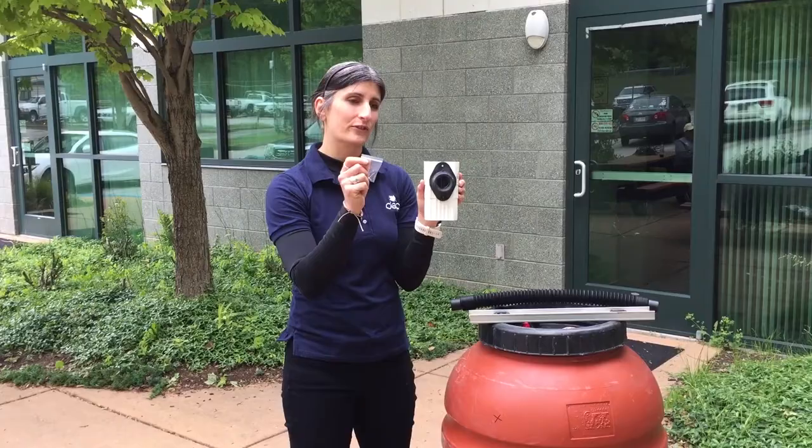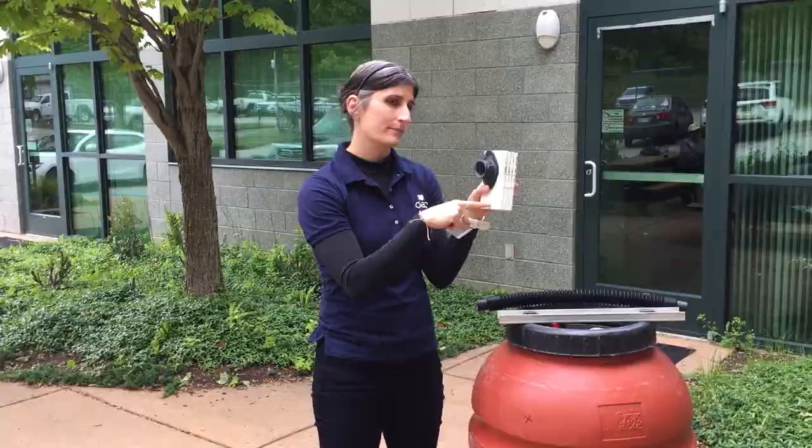If you're installing on a three-by-four downspout, you will be drilling into the side rather than the front. The final thing in your kit is the 'do not drink water' sticker — be mindful of where that water is coming from. It's washing off your roof, going down through your gutters and downspout, so it might pick up bird feces or insects. That's why we encourage you not to drink your barrel water, but you can use it for many other things.